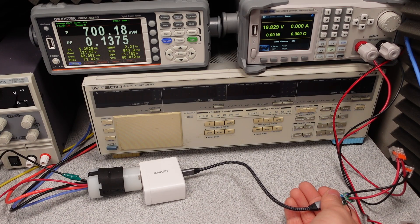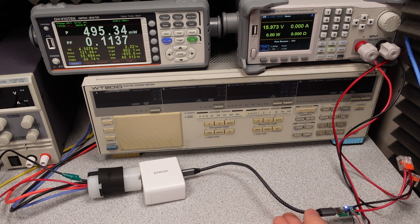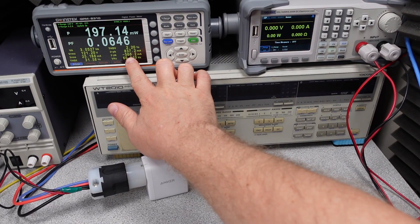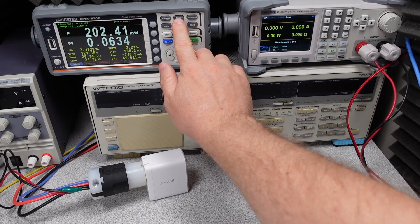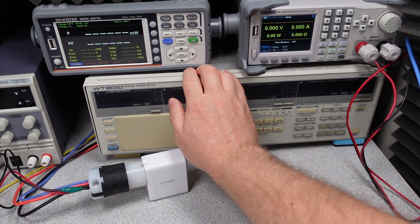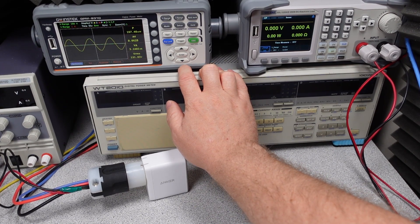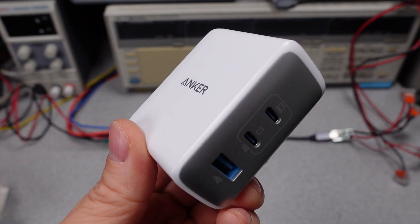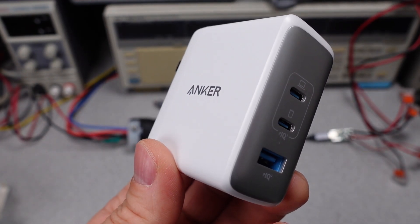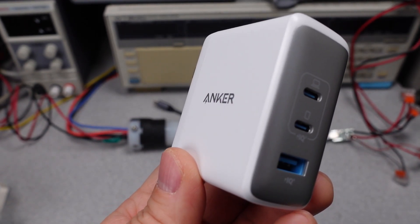We also get a 16 volt programmable power supply mode, which is a variable output voltage mode. The USB-A port does support QC power delivery modes. The device appears to operate as intended when switching between the various ports. The USB-C port does reset when plugging and unplugging things. The USB-A port seems to operate independently, as long as you don't overload it — then it resets all the ports. If the power is exceeded on any port, the USB cable has to be unplugged and re-plugged in to restart the adapter so it can supply voltage and current to your device.